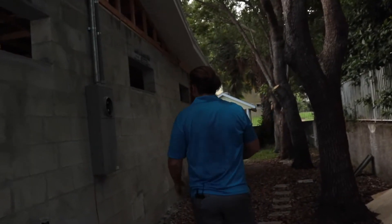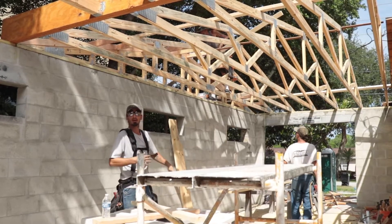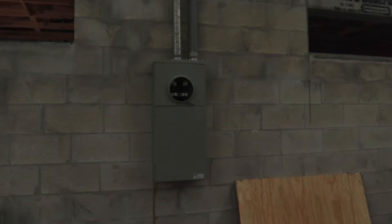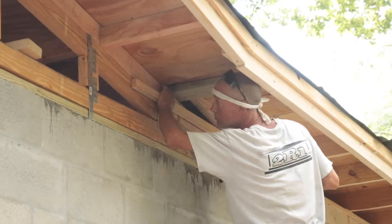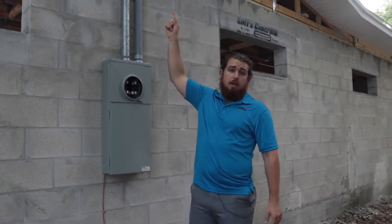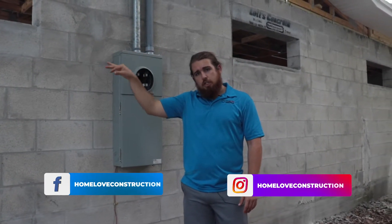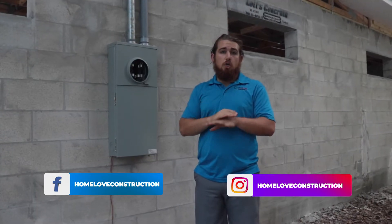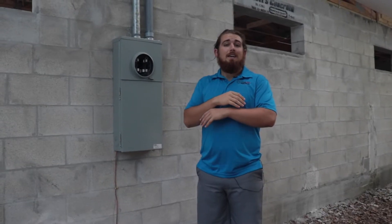The only lingering item we're being held up by is right here. The city of Tarpon Springs required us to move the actual meter can from the middle of the roof to the outside of the roof. But we're waiting on the city to tell us it's okay to have the company come out, disconnect from the old weather head, and hook us up into the new weather head. Once that's done, we can finish our tie-in, put the roof on, shingle it, get dried in, and then we'll be done with the upper structure. We'll put our windows and doors in, stucco, paint — and this guy's done.